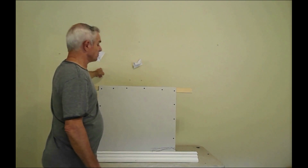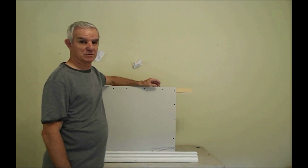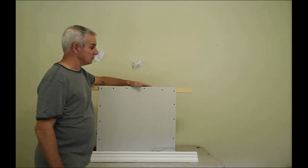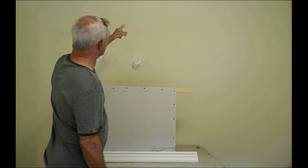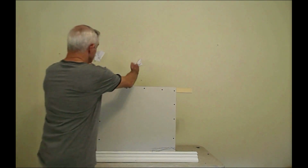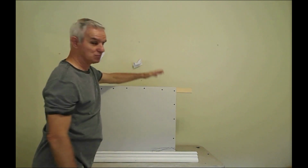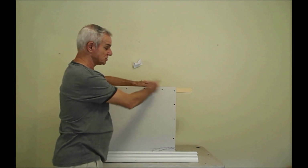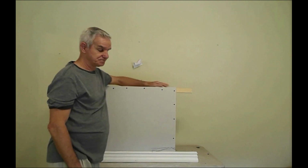They're 16 inches apart. There's different code requirements for different lengths. What I've built here is 20 inches. But basically what you have is the 2x4s going all the way to the top, to the bottom. Same thing here. They block this in. The top there's a 2x4. The bottom there's another 2x4. It's sealed in. There's no air getting in there.